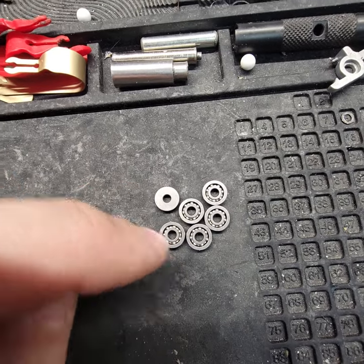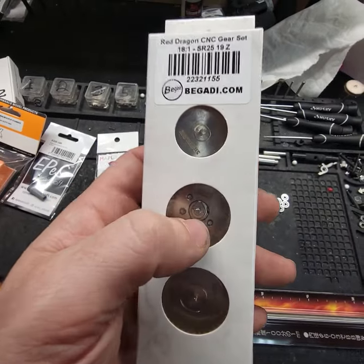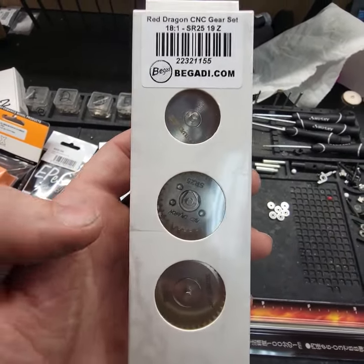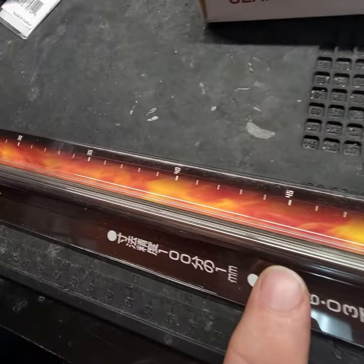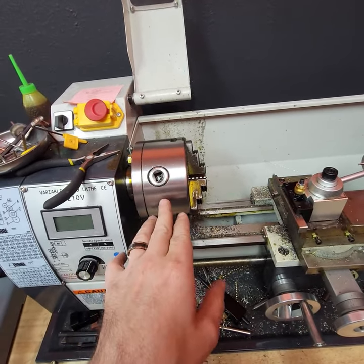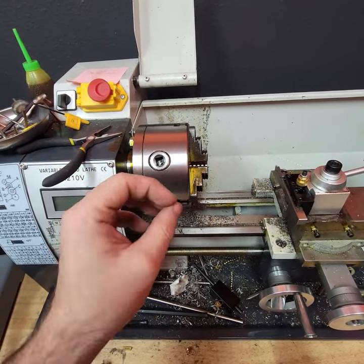This guarantees I won't have a failed bushing — and it's always the one underneath the spur gear. For the gear set, I'm going to give these Red Dragon 18:1 SR-25 gears one more try. At first glance they look nice, but the issue I keep having is the gear mesh and the fact that the spur gear is usually warped. So we might use these, we might not — we might just use the sector gear and use the SHS bevels and spur. We'll find out when we get to the build. We're also using a Prometheus 603x509mm barrel, and I'm going to put it on my lathe and shorten it down to about 470mm. The reason is because this customer is using 0.40 gram BBs, and at 509mm the back pressure from the heavy BB will slow down the piston enough to cause premature engagement — I call that air braking.